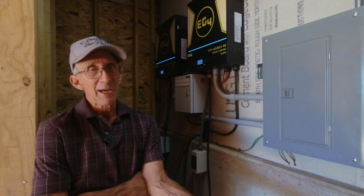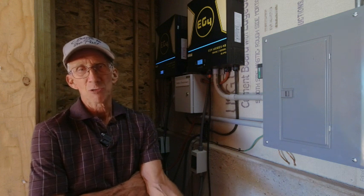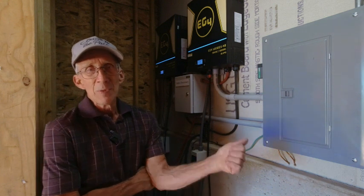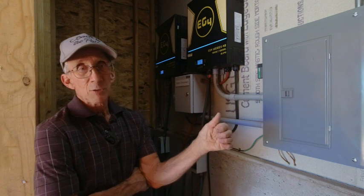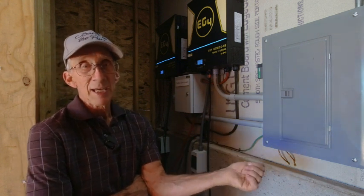For this location, I've seen 9 below zero — that's probably as cold as it's going to get. You have to increase your voltage requirement by 25% at that particular temperature.